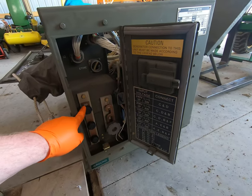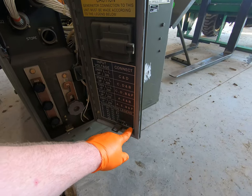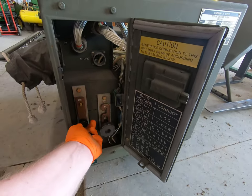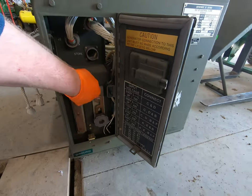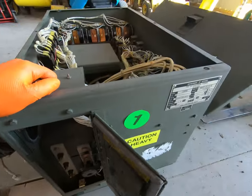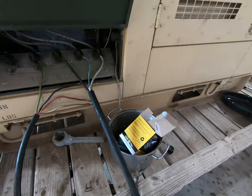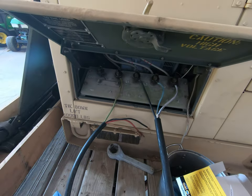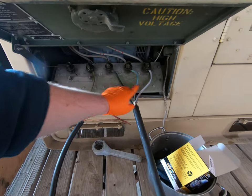For three-phase testing, there is no BB bus bar connection — that's only for single-phase, where F is BB to L1, L2, and L3. To test this as a three-phase piece of equipment, you have to remove that bar. I'm going to hook up the wires using 50 feet of four-wire 8-gauge wire. I'll use the green wire for ground and the three remaining conductors for L1, L2, and L3. Ground and neutral are tied together.